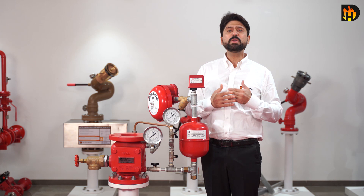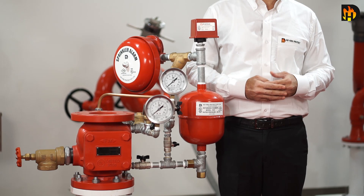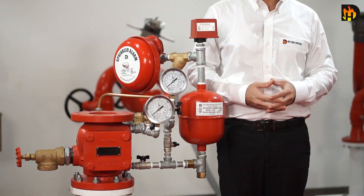Operation of one or more automatic fire sprinklers causes water to flow into the sprinkler system, allowing continuous flow of water and transmittal of alarm — both electrical and mechanical. In the event of variable pressure conditions, false alarm is prevented by a retard chamber, which accommodates extra water due to pressure surges.